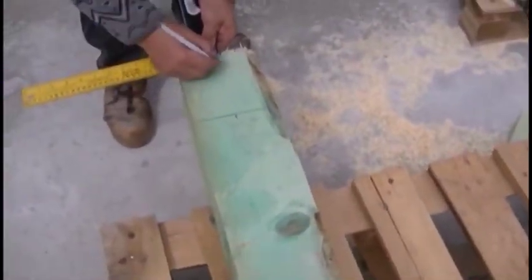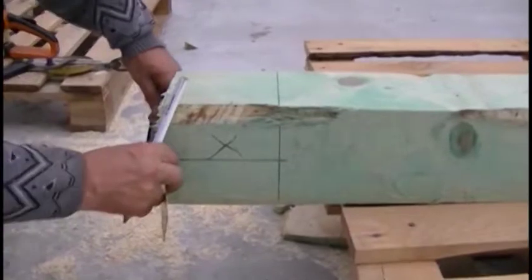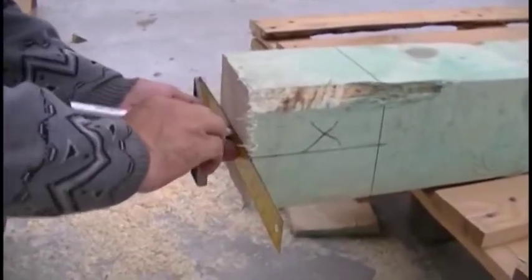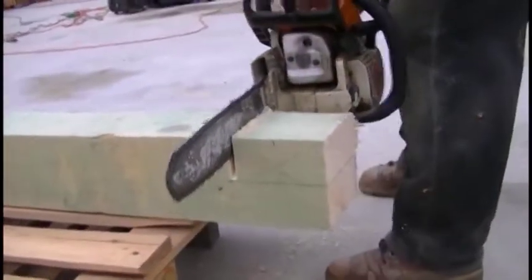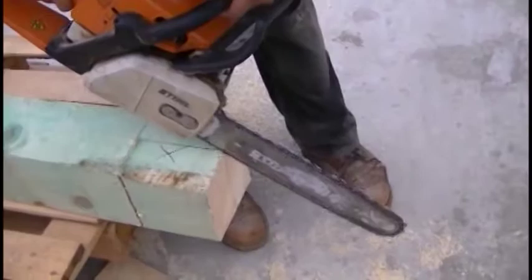The work starts with the preparation of wall plates, which as you can see in the video, we will do with timbers of section 14x14 cm. It is a relatively simple process. During the construction of the wall plates we don't have any complicated cuts. Actually there is only one type of cut prepared, cut in such a way that you can see now.